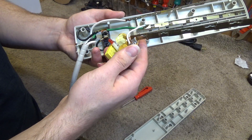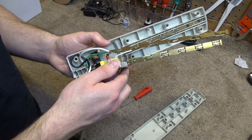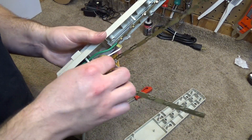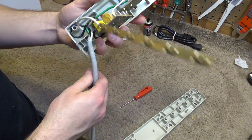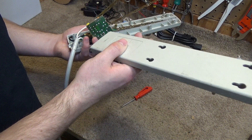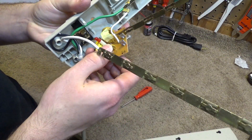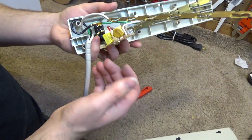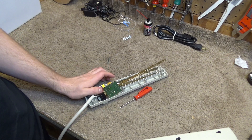The switch is always a good thing to look at. It's really kind of odd — it doesn't seem like it should have quit. This is all bent over; I'm not sure if it's supposed to be like that. But you can see how this is not really a good protector. This is a surge suppressor rated at 400 volts. You can see it isn't really a good one — all it's got is a couple of these components. I forget what they're called at the moment, but it doesn't have a lot of protection at all. This is one reason why you don't want to buy cheap protectors.